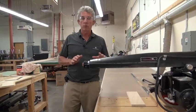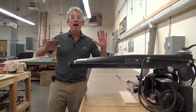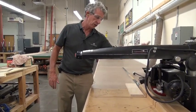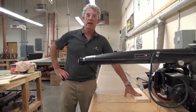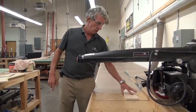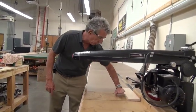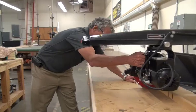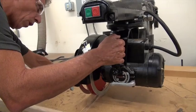When you are cutting with the radial arm saw, board on the table, against the fence. I've had students put their fingers back here — the blade is spinning in this direction, it grabs the wood, pushes it down and pushes it back. So fingers never behind the wood. The blade is spinning; it's going to grab the wood and push it back. When we pull the blade forward, it has cut the wood. You don't have to come all the way past it — right there, when the center of the bottom blade clears the wood, that's as far as you need to go.